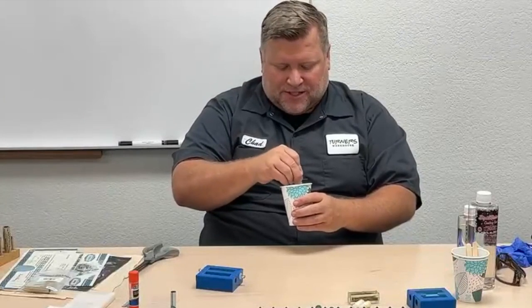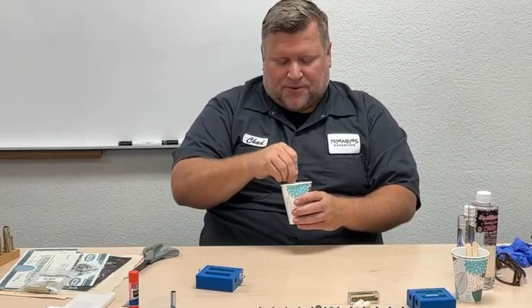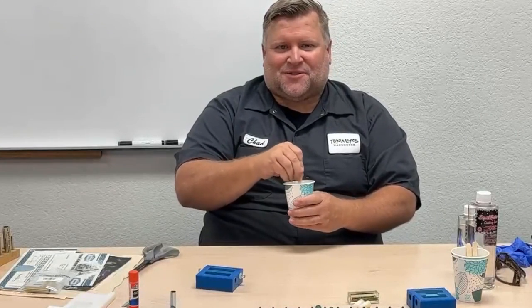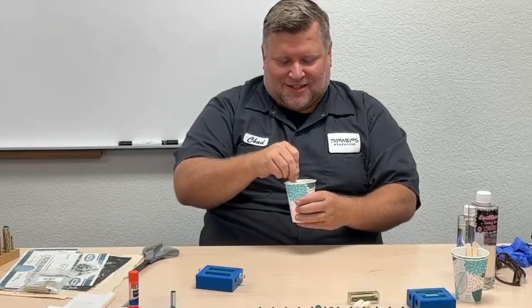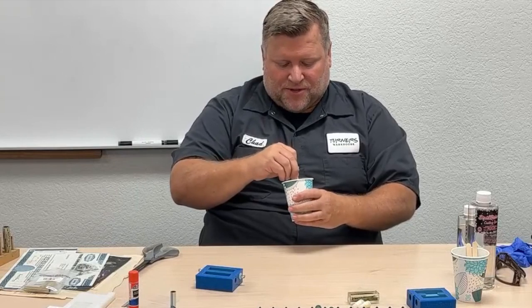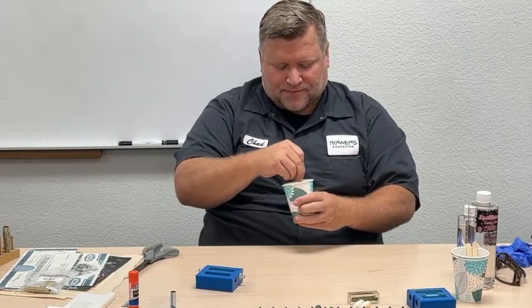Somebody called me once and said, hey, my resin won't cure, and I was like, well, tell me about your situation. And they were casting in like 12 degrees. So essentially their resin was freezing, which means it would never build up temperature to cure. So always make sure that you're in an environment where you give your resin a chance.